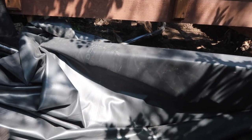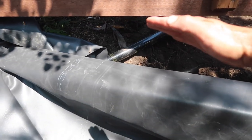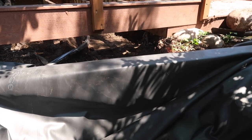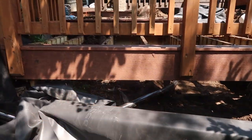I've got a 2x6 underneath the liner here getting it nice and flat, with all the wrinkles pulled out so it's nice and taut. I'm going to prime this area, put a piece of our double-sided tape — sticky on both sides. I will prime the top liner, drape it over the top, seal it, and trim off any excess not held by the double-sided tape. Then I will prime it again and put our 6-inch cover tape over the top. Basically we're welding the two pieces of liner together, making a watertight seal, and then get that liner to go underneath this deck.